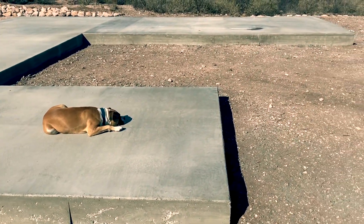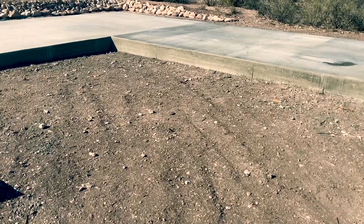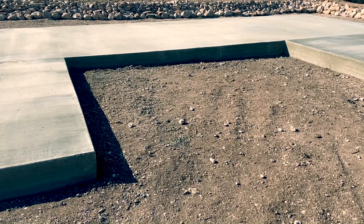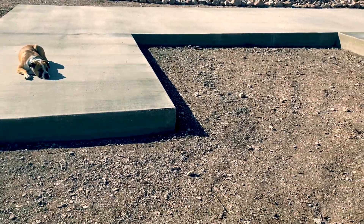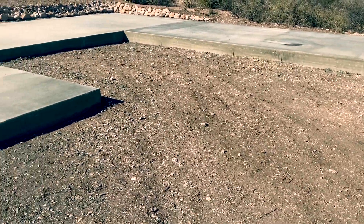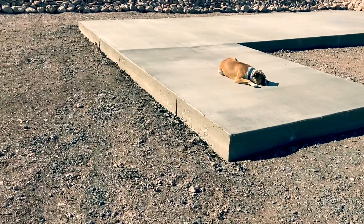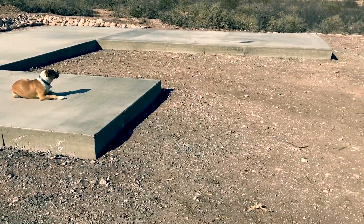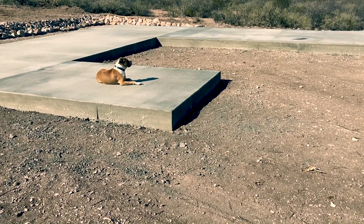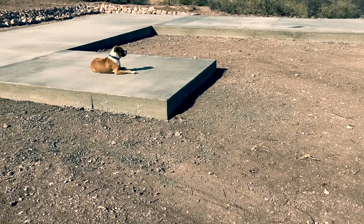Another important thing is that I also added 1% calcium chloride to the mix. That's an accelerant — it accelerates the curing process by speeding up hydration. In other words, the concrete absorbs the water much more quickly, and the calcium can speed that up by up to about 60%. I did that because the day we poured this, it was about 35 degrees Fahrenheit when the concrete was poured, and it didn't get any hotter than about 50 degrees during the day, and it was overcast. If I didn't put an accelerant in it, it wouldn't have set up — it would have just remained what they call plastic, basically soft and wet, and probably would have frozen overnight, which would have ruined it.